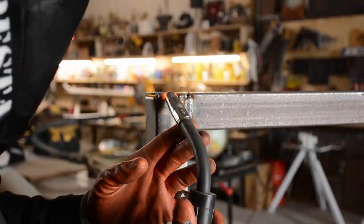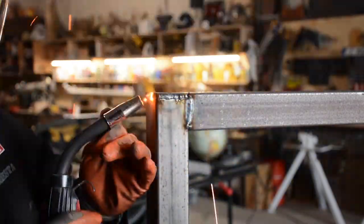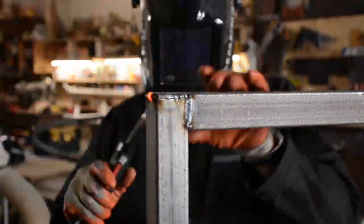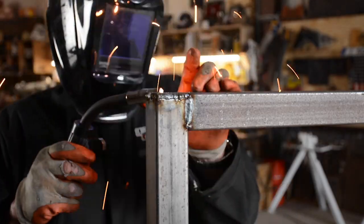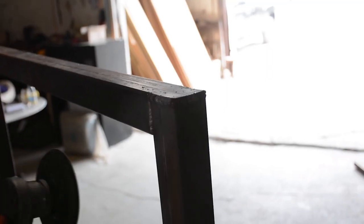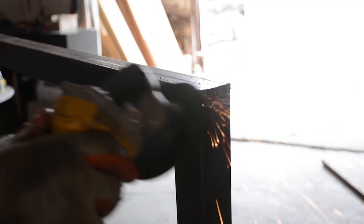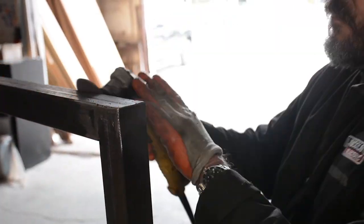This is what I was talking about when I'm welding left to right — otherwise I would have melted through. I go left, right, left, right: while I weld one side, the other one is cooling off, and I keep going back and forth. That's a technique I developed — maybe out of being a bad welder, I'm not sure. But when you weld thin-wall stuff, it's always difficult. You run the risk of setting it too low and not getting good penetration, or too high and you end up melting. So I'm trying to find a happy medium.